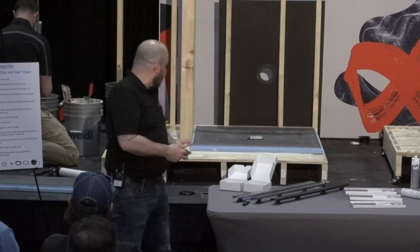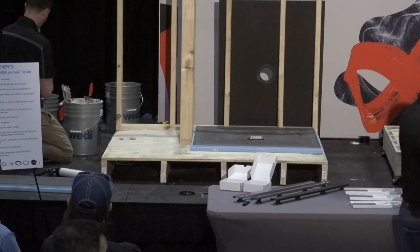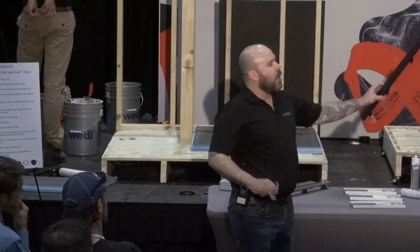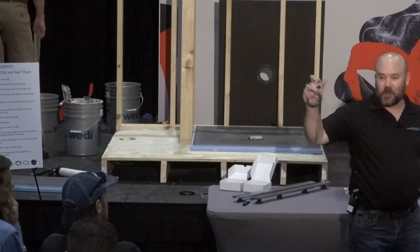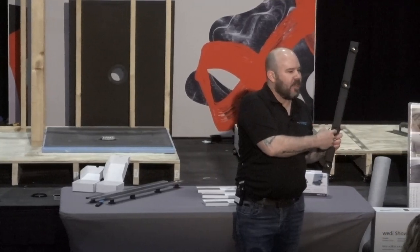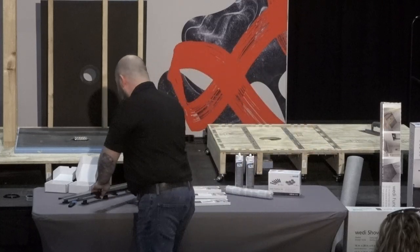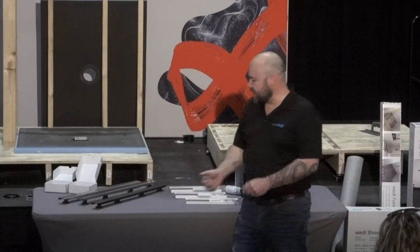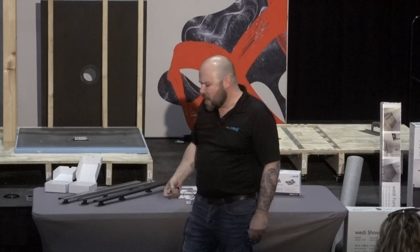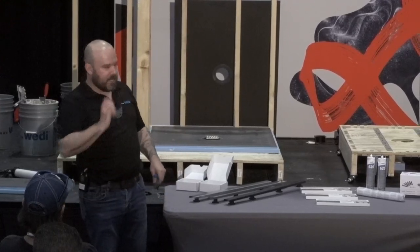The gray pieces on the line drain are spacers that you tile right up to — they show you where to make your cuts on your tile. They're also little handles; these feet can screw onto the ends for a handle so you can hacksaw them for major height adjustments. You also have finite adjustments with an Allen key inside the feet. We just introduced the matte black linear drain for the Riolito. This is why we invite you over to our booth at 3930 — just a hop, skip, and a jump right there.